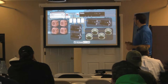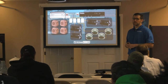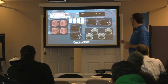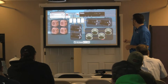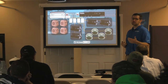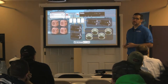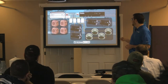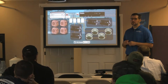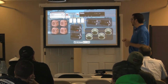Whether it's outside or close enough that I can just get the speaker wire through the wall, now I'm going to four volume controls. Imagine one by my pool, one in my garden area, one on my patio. I have a volume control in each of those areas. If I'm at the pool and want to turn it up, I can. If it's wintertime, the pool speakers don't need to be running. But this is still one wire going to each volume control, then a wire from each volume control out to the speakers — no impedance matching, no series parallel. Just run one to the next, to the next, to the next.